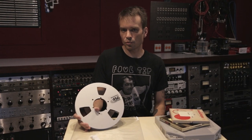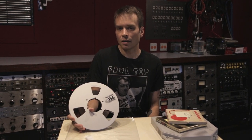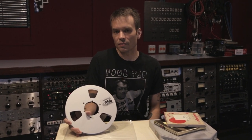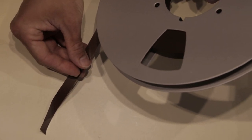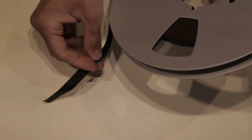Analog audio tape has two or three main layers. There's the base film which, since the 1970s, has been polyester or PET. Onto that base film there's at least a magnetic coating on the inside of your tape. The mag coating layer is slightly brownish in color and a little bit shiny, and it's where the analog of your audio is actually written. On the backside of your tape is your back coating, if your tape is back coated.